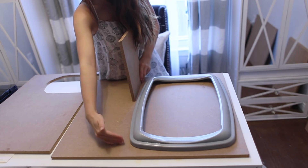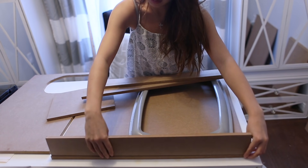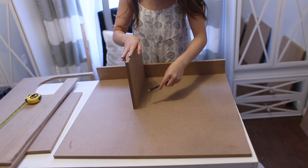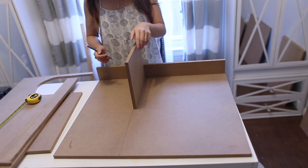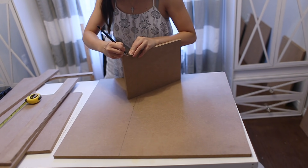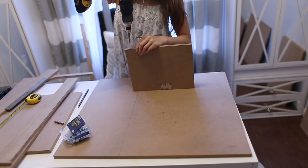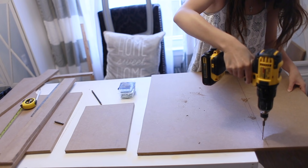To get started with the litter box section, I'm beginning with the inner wall, which is shorter than the outer walls. I use the lid of the litter box to measure everything and use spare pieces to find where that middle piece should be. Once I have that, I outline where the board should go and mark three spots for screws. I pre-drill the hole first so I don't miss the mark when drilling through the board, lining everything up before attaching with screws.